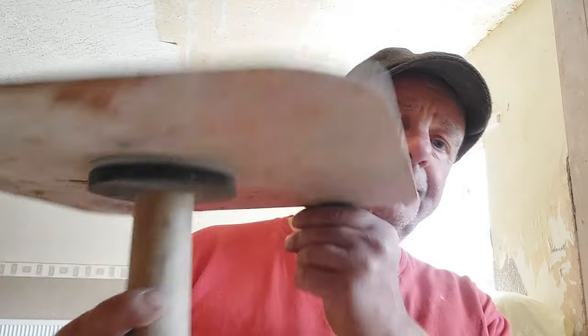Right, and then of course a bucket trowel that you're desperately needing a clean. I do have a clean one somewhere, but I don't think I brought it. And that's pretty much the tools that you'll need to undertake an over-skimming job. You know, it's not a case of you turn up with a trowel and hand board. And what's a hand board? Well, known as a hawk. I have several of those, all different sizes. I use them for different types of plaster work.